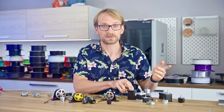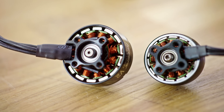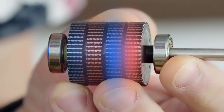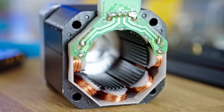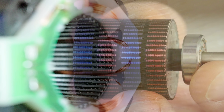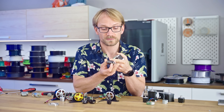Side note: how do stepper motors get their steps? They have 200 or 400 steps per revolution, and that is an insane amount if, for example, you wanted to get that many physical steps from a BLDC with individual magnets — you'd need 200 magnets. How steppers do it is by just using one, or in this case two big magnets, packing them into an iron core and giving that core ridges. Because that iron core is so good at guiding the magnetic fields, wherever you get an air gap — or in this case an air gap filled with resin — it's like that field isn't even there. So the way that the ridges in the rotor and in the stator line up is that you first get one pole of the rotor lined up, then you turn it a little bit and suddenly the other pole is lined up. It's like having hundreds of little individual virtual magnets, and it's what gives steppers such fine resolution even with just one or two magnets.